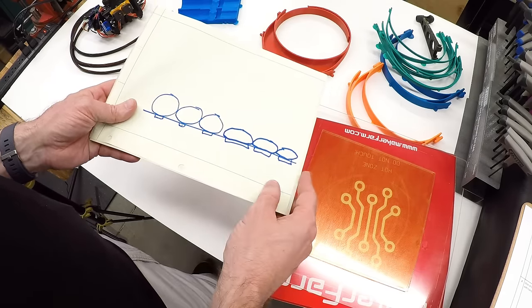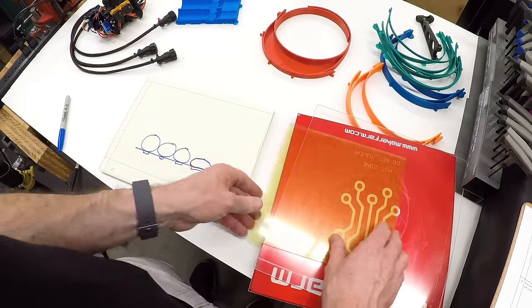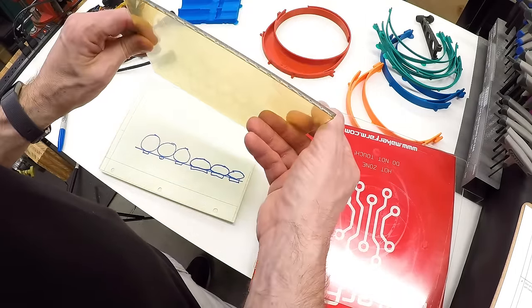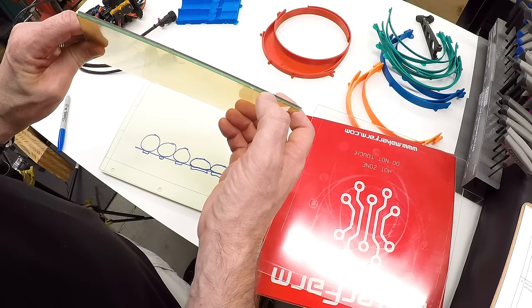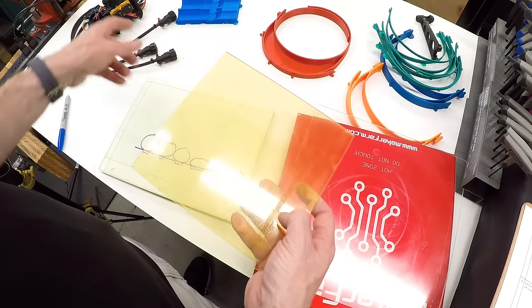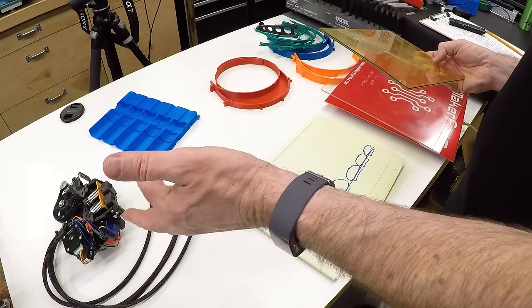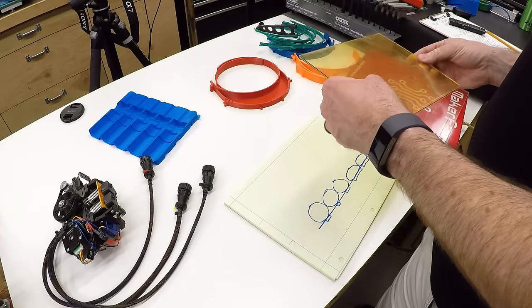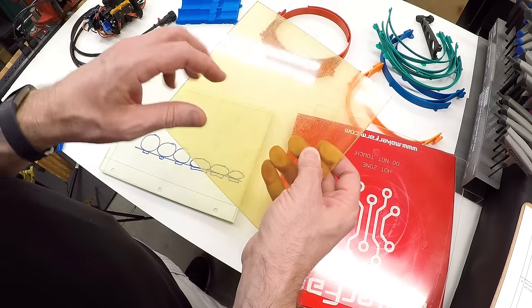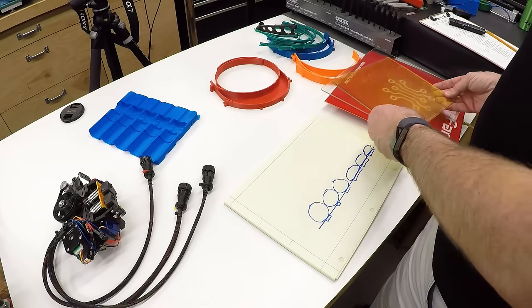The reason I prefer the old-school switch over an inductive sensor is that the inductive sensor doesn't read the glass or the printing surface — it reads the metal plate underneath. So if you swap out your glass for a sheet of glass with PEI on it, it's now two millimeters thicker and your Z height will be wrong. But if you're using the switch probe, it comes down and probes the top surface directly. I set my printer up probably five years ago, zeroed it, and haven't touched it since. Swap out the surface — different sheets of glass, different thicknesses, with or without a PEI sheet on top — it doesn't matter. Just drop it in, hit print, and the Z height is always perfect.